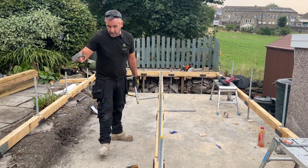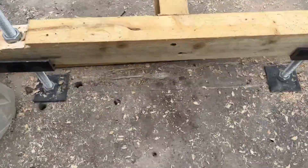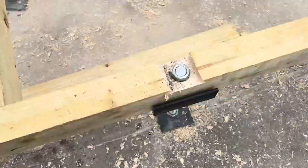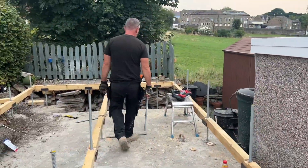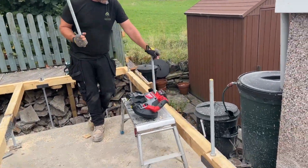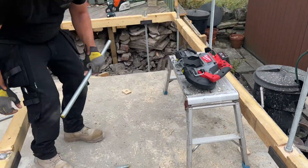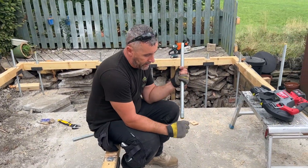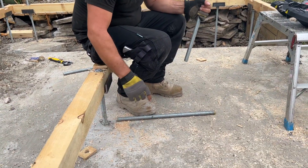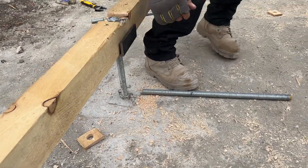What we did was go around with a drill, drilled a series of pilot holes, and made sure the concrete was the same depth all the way around — which it was. We then went around with a 28mm drill bit and drilled six five-inch holes all the way around on the pad. Then we chem fixed the rods in — it's a chemical fixing process where we drill a hole bigger than the rod, fill it with chemical, drive the rod in, the chemical goes hard and bonds the rod to the concrete.